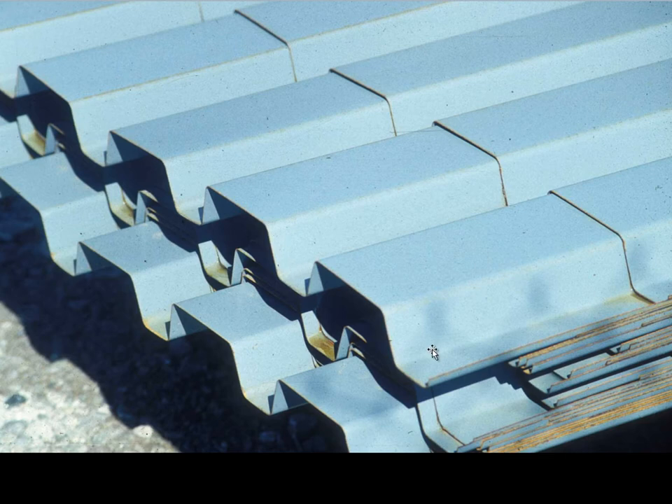The corrugated decking is smooth, and this one happens to be one and a half inch. The corrugated decking is designed so these sheets nest around each other, so it's possible on a single truck to bring huge areas of this corrugated decking, transporting it very efficiently because in essence this is solid steel — or at least fifty percent solid steel — when all these things are nested into each other.